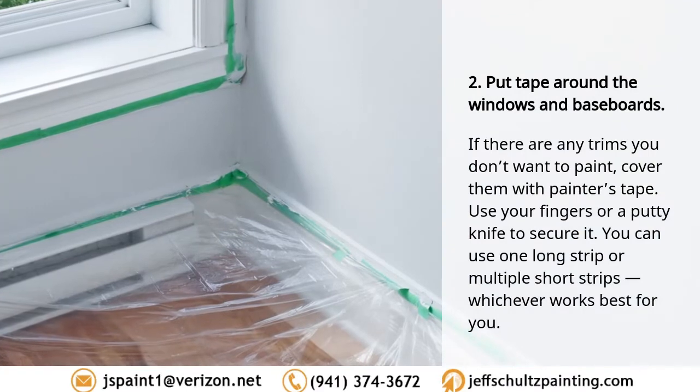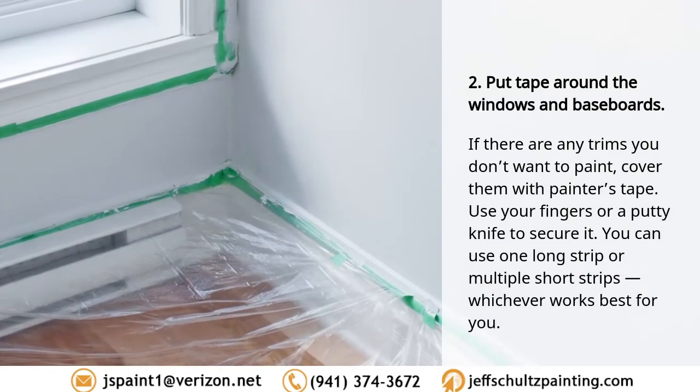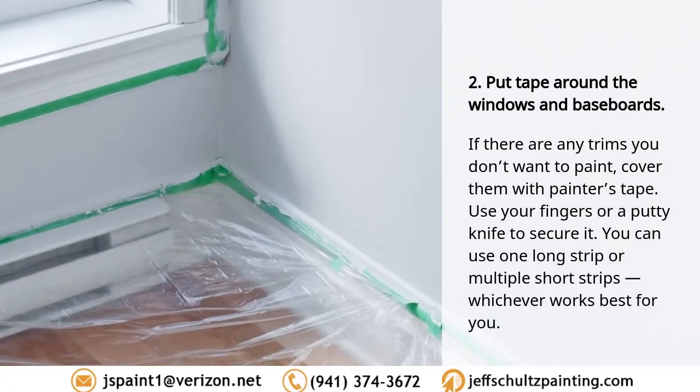2. Put tape around the windows and baseboards. If there are any trims you don't want to paint, cover them with painter's tape. Use your fingers or a putty knife to secure it. You can use one long strip or multiple short strips, whichever works best for you.